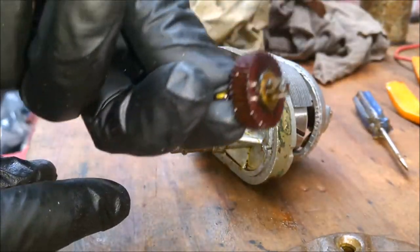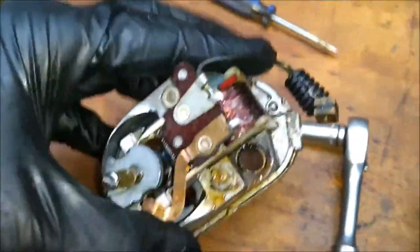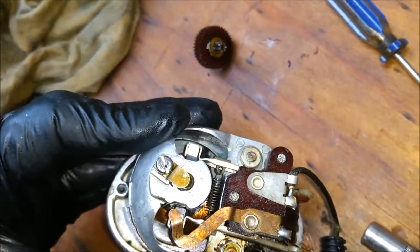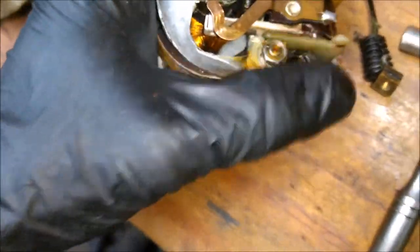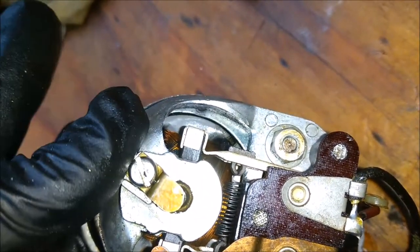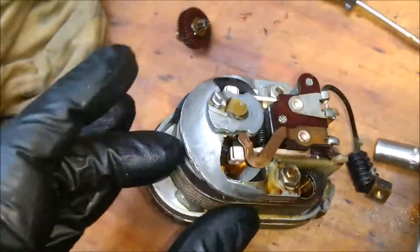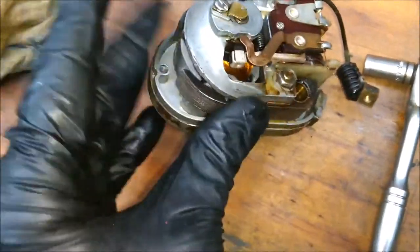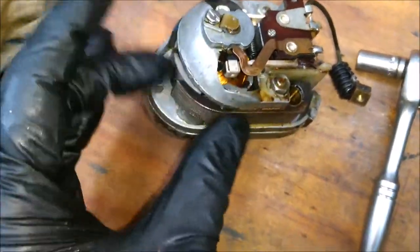There we go — with that out of the way, I'm able to re-tighten these two top nuts. But before I do that, there's actually play — I'll loosen her up a bit. You can see the play there. So I'm spinning the motor around like this until I get a nice smooth action, because I don't want it to be binding. Just keeping it nice and smooth and then nipping them up as I'm going. I've set it up — it's all greased up, you can see here.